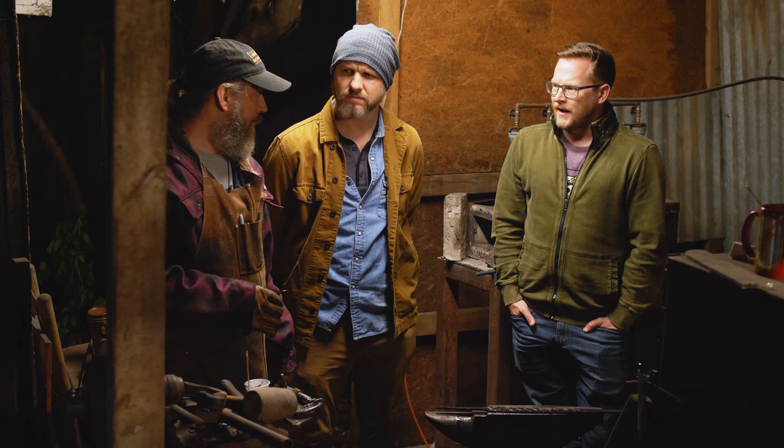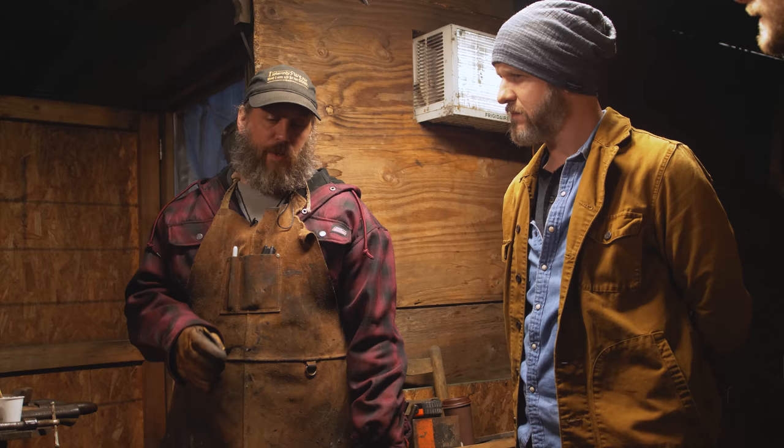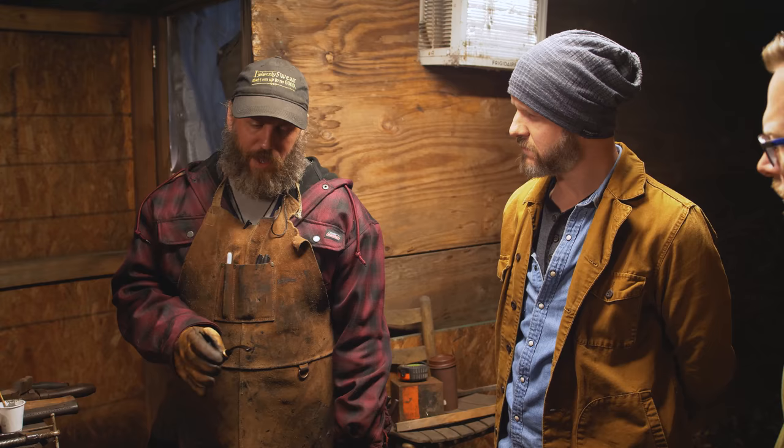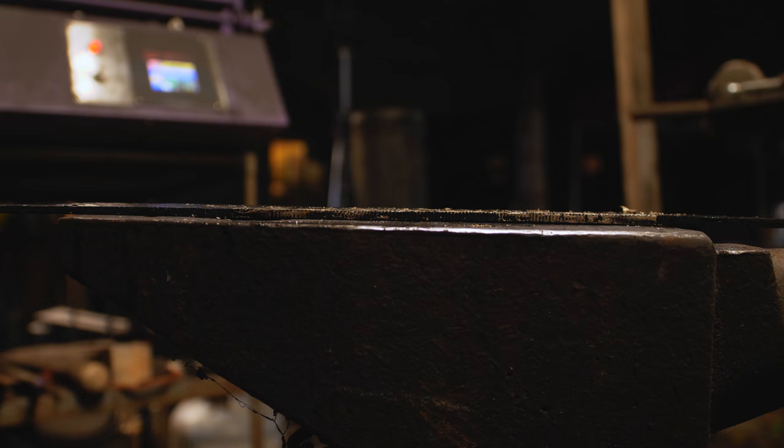And that's your last window to make any last adjustment. Well, yeah, because we're pretty much done as far as heating it up and cooling it down and stressing out the blade. From here on out, we temper it, so we finish relieving that stress, and then we're just grinding. We're not really putting any more stress on the steel at all. But it was very, very slight to begin with. It might be completely gone after this is done cooling. And if it's not completely gone, what is left over I'll be able to get rid of after I temper it. I can also do this.